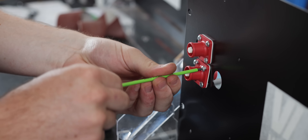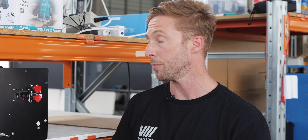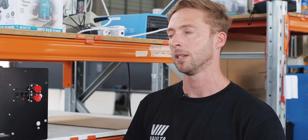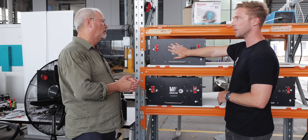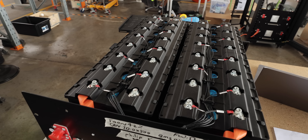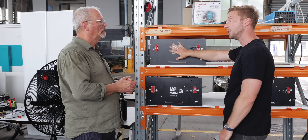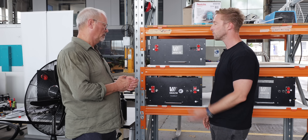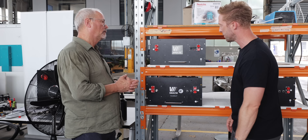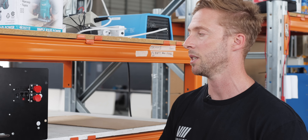These will stay as a 48 volt battery, so they're typically installed with a low voltage hybrid or battery inverter — and that's basically your system. For a residential system this is usually more than enough. But for a larger off-grid system we've gone up to three of these in parallel, so that's around 40 kilowatt hours. Some people use two batteries for around 28 kilowatt hours.